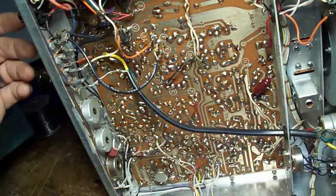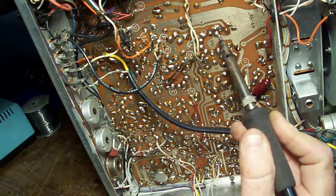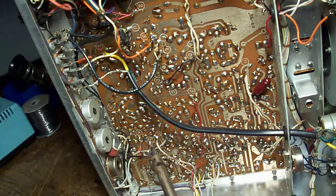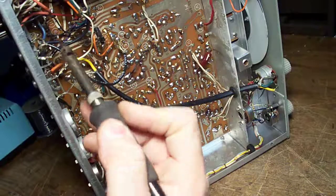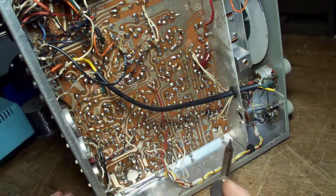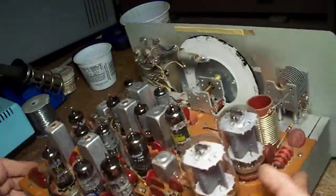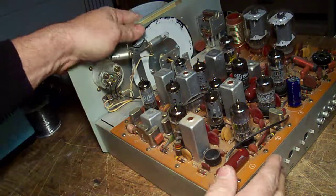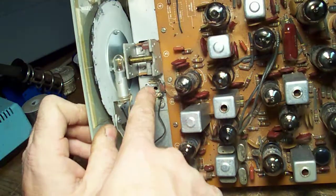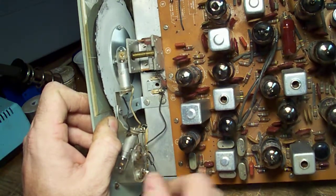Now to restore one of these, basically all you have to do is take your soldering iron — which in this case isn't heated up — heat up the pins, pull them out, push the new one through and re-solder. It takes a little bit of dexterity but it's really not too bad. Beyond that you've only got a few different controls and these are outlined in the Heathkit manual. For alignment you've got this knob right here and this pot here. These coils generally are not touched and they're factory calibrated, as I remember.